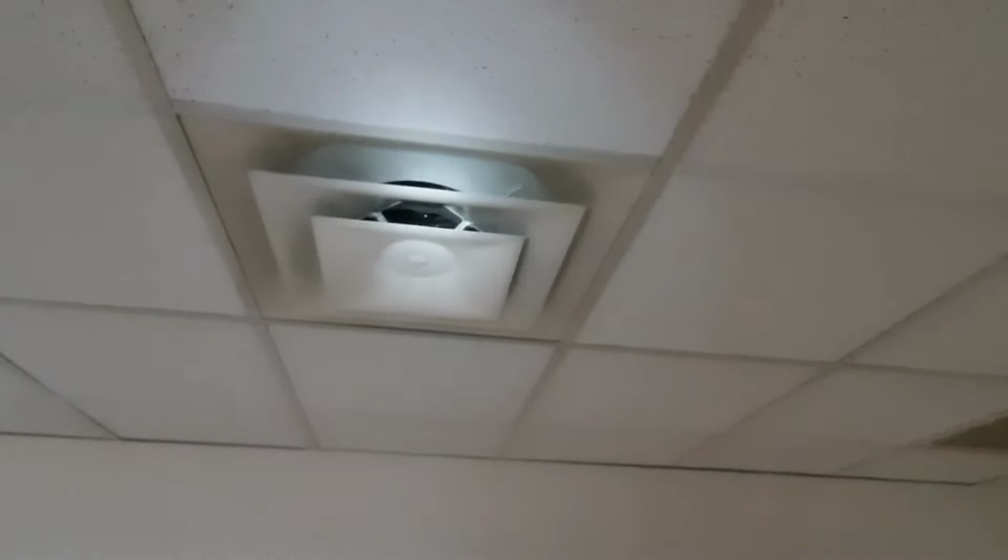So the last thing I'm doing is just checking my vents. These do have butterfly dampers up in there. All of them look like they're open. If we have any more issues out of it, everything's clear on my returns, but I just want to make sure all of them are open. If we have any more issues, we may have to get above the ceiling and just see the duct up top, because I'm sure it's probably pulled tight and stretched out pretty well.